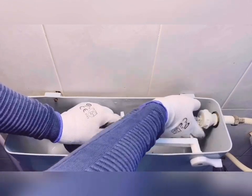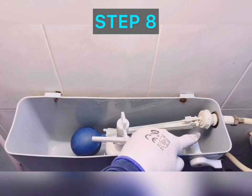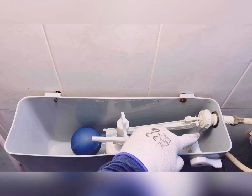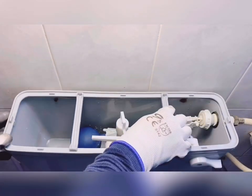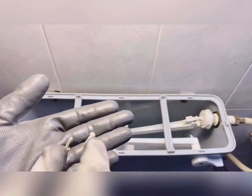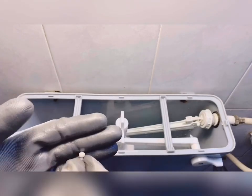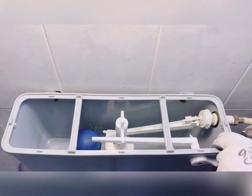Make sure that it is actually sitting on the thread and please do not over-tighten it. Step eight: open the main valve and check for the flow. Step nine: fixing back the frame. While fixing the frame, make sure that it is actually sitting in the slot. After fitting it properly, put back the locating pin. Before fitting the pin, just check the condition of the pin. Align the hole properly and then press the pin. Repeat the same step for the other side.